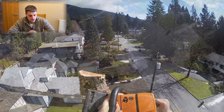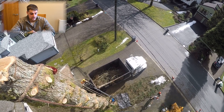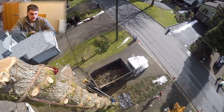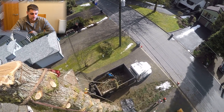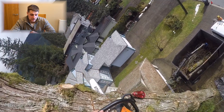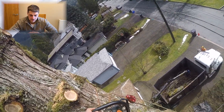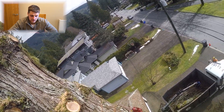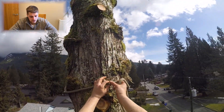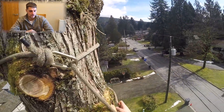Joel's doing a decent job here of leaving them suspended — you're slowing them down, that's the idea of rigging, you're gradually slowing things down. He's leaving it suspended and Jeff there with the grab is picking it up and chucking it in the van. But looking back, picking up the bit of timber with a grab while the rope's still on it — we're basically putting a mechanical steel grab pinching onto the rope. There's a good chance that could have weakened that rope. Just flipping that carabiner 180 degrees so the gate's on top, pulling into the other corner of the carabiner, would be better.